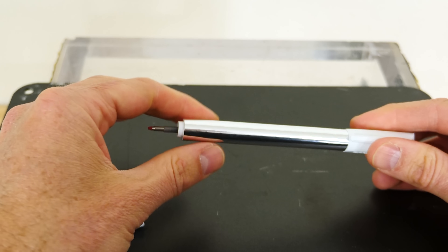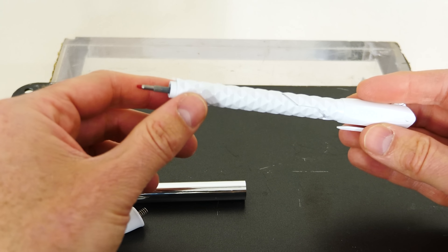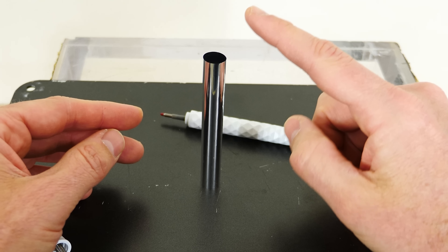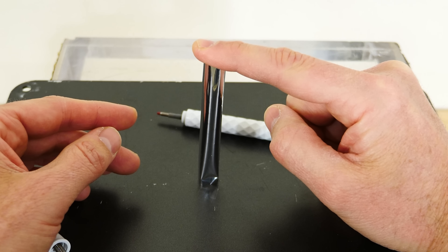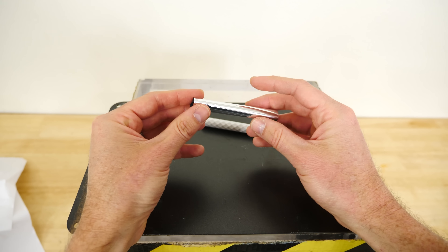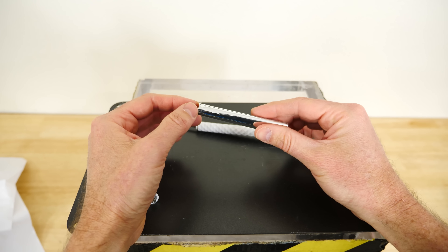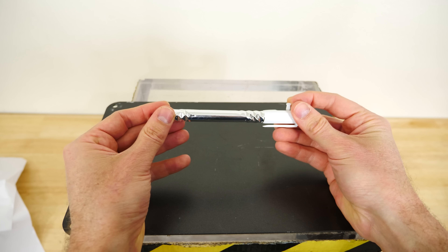It just slides off — that's all it is. It looks like a metallic-coated piece of plastic. Here's the cylinder. If you try to crush it normally, you can see where we deformed it — we went past the elastic limit. So this device is meant to not let it go past that elastic deformation point, so that it doesn't leave any permanent creases. I can put it back on and still see a little of those creases, but it still works.